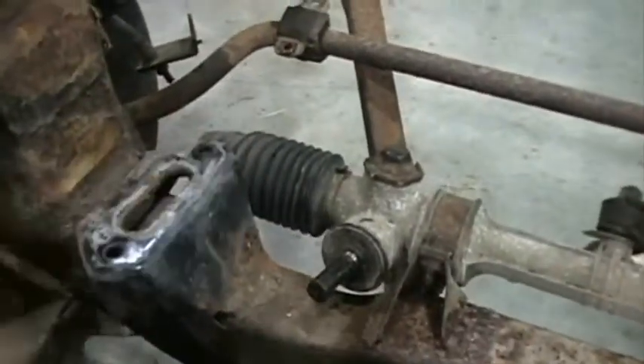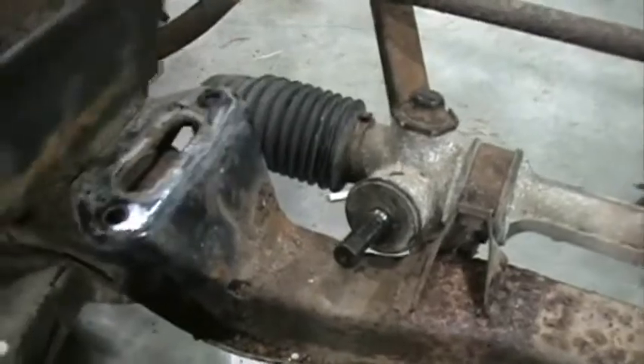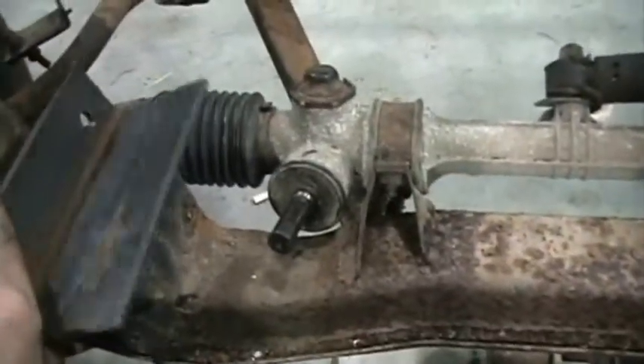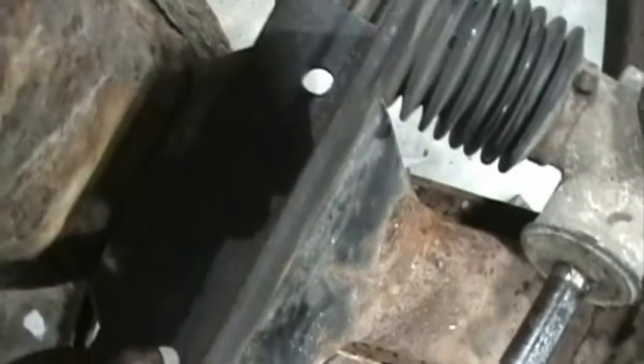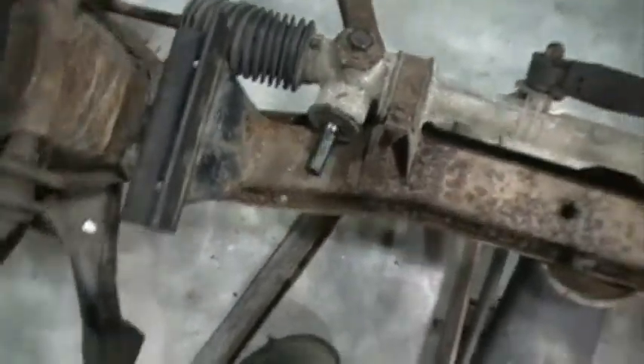What we're going to do to connect this to our 2x3 and 3x2 box tubing — I want to keep this removable if I ever have to take it apart and fix it, and I'd like to sandblast some of this stuff and clean it up and paint it before I put it in. I'm going to take some oblong angle here, 2x3 or something, and made our one precision hole up front here and that's where it'll line up. We'll run a bolt down through that and weld the head of the bolt in, then the nut and lock washer will go up from underneath and hold it.